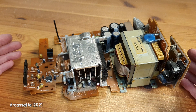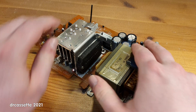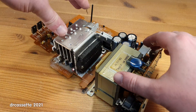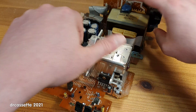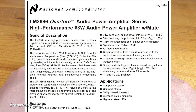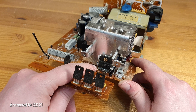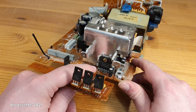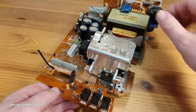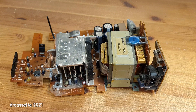Finally, after taking off this board, I have discovered one component in this system that is really interesting. I just said that there is a separate subwoofer output, and that is not coming from this STK chip. There were STK type hybrid amplifiers with three outputs, but in the case of this system, the subwoofer output comes from this chip down here — an LM3886TF. I have actually been interested in this chip — I thought about ordering a few of them, because this is a really good amplifier chip. Now I have one of them for evaluation, so that's really good. So I guess that means this teardown has been totally worth it.